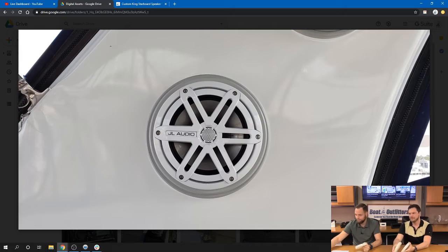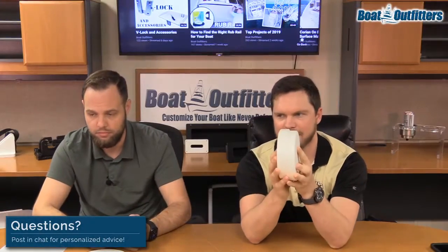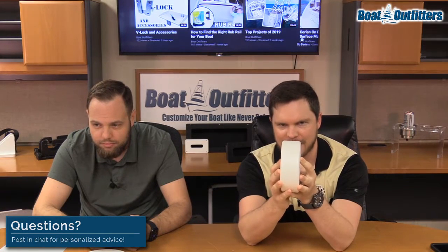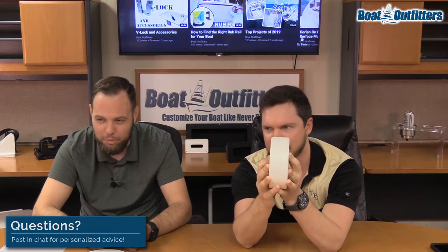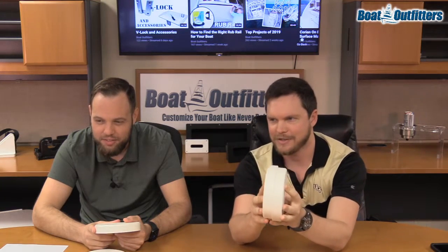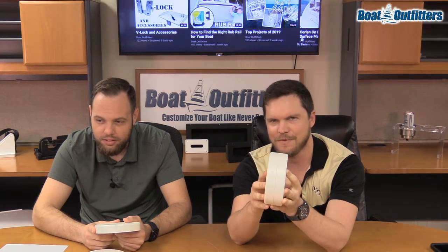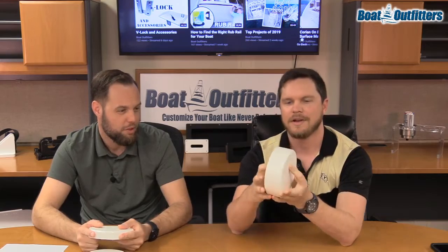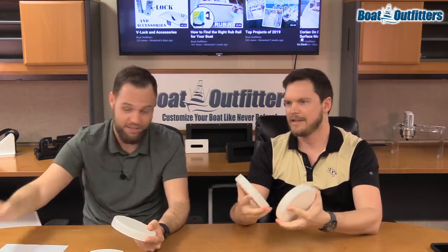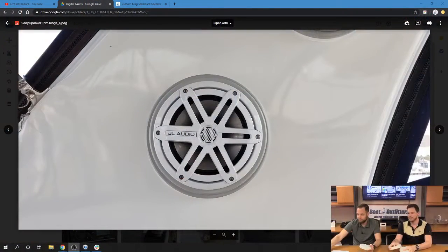If you want to jump back over to the screen real quick, I'll try and portray it. But if you see this, it doesn't matter. These are the same exact diameter. It doesn't matter how hard I try. You're going to see a line in between the two. I don't know if it's hard to see, but you can see the line there. You could try real hard, and if you hit the nail on the head, you really got it perfectly lined up. You're still going to see the seam. It's almost better to accentuate the difference. It's better to avoid trying to hide the seam and just acknowledge it. You can step it out a little bit more.